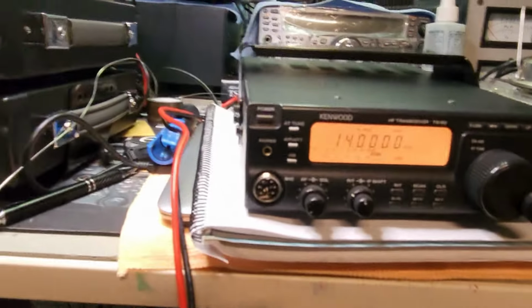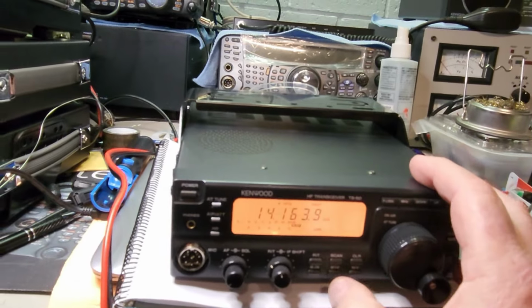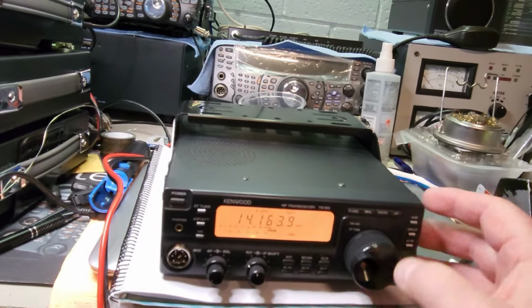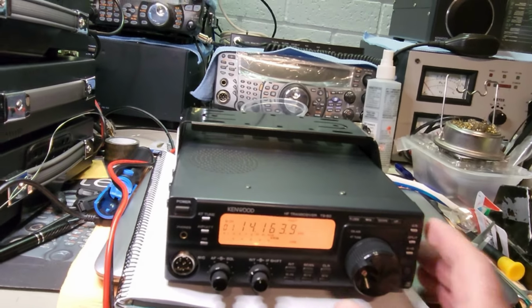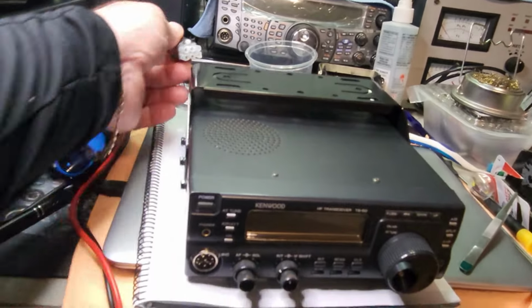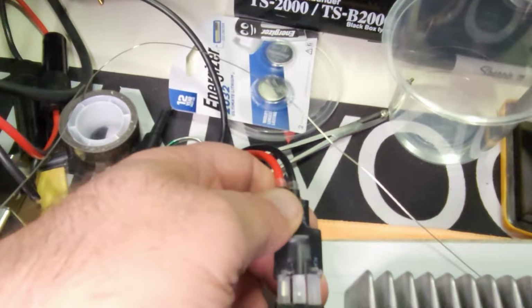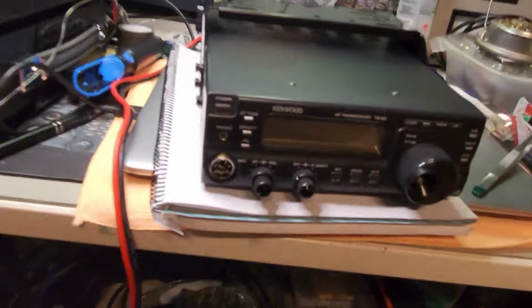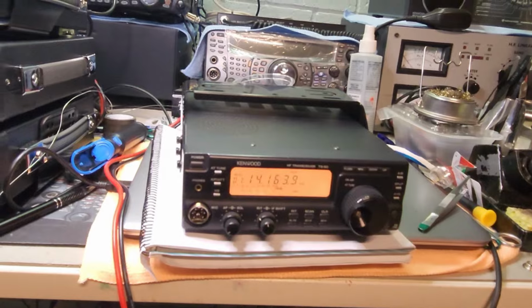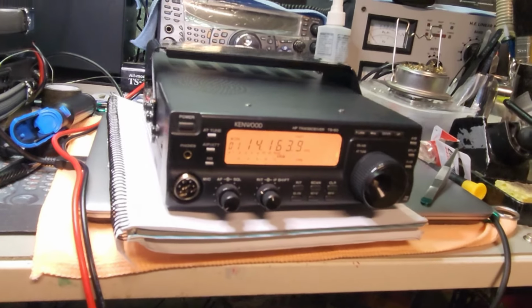Alright, it's stayed fast. The other thing that I need to check is this side of things, and we go in and go into the memory. There we go. We turn it off. Disconnect the power. Put the power back in again. Okay, and for the first time it didn't turn back on again when I plugged it in, which is correct. And there we go. The memories didn't get cleared, and that's how we know that it's all worked quite well.